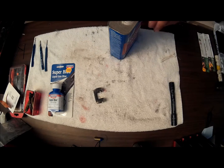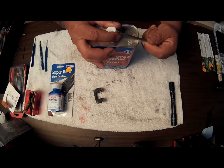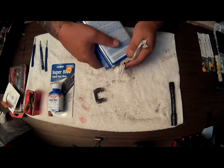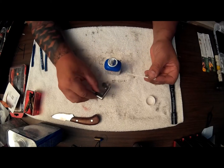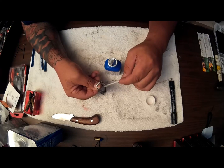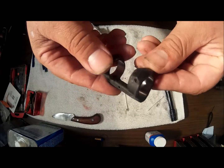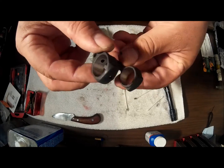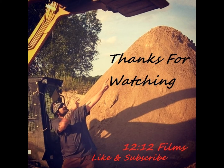Use denatured alcohol to clean everything once you're done — you want to get all the oil off before you finish it. You can paint this with a high-temp engine paint; I'm going to use cold blue. I'm using a Q-tip to apply it, and you can see once you start applying it, it turns pretty quick. Apply a coat, flush it with cold water. I applied two coats and that seemed to do the job — it's pretty black, the metal is protected, and I shouldn't get any corrosion or rust. Thanks a lot guys, hit the like button and subscribe.